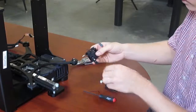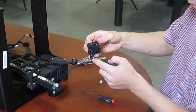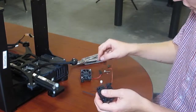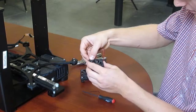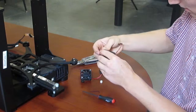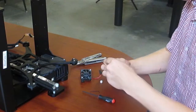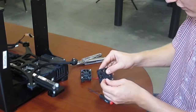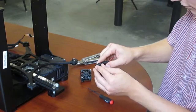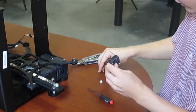After you've done this it's time to mount the large fan. The large fan will mount on top of this bracket. Before you do so, take an M3 washer and put it over the top left corner. After you've done that, mount it to the bracket using an M3 by 22 bolt. Stick the bolt through the fan and through the washer, then through the bracket and secure it with a nut.